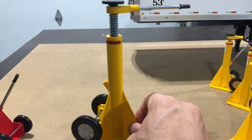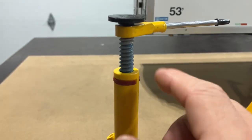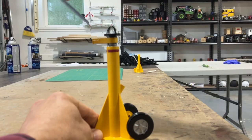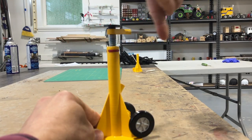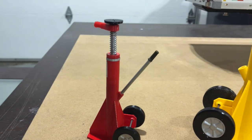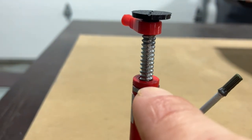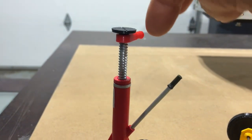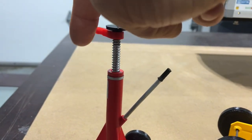I started off making this in a larger scale — this is probably like 1/8 scale — just so I could see the operation of some of the pieces in a little more detail. I made a mistake on this one: I printed the screw portion a little too wide and it kind of grinds going down. I've since changed that and it's a little looser now. It's 130mm to the top and 105mm all the way retracted, so you've got about 25 millimetres of extension.